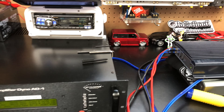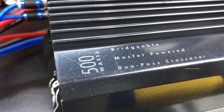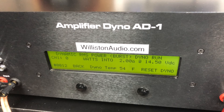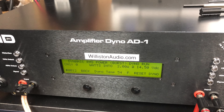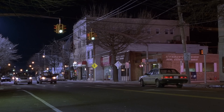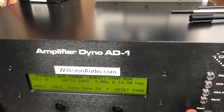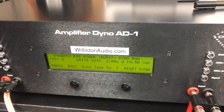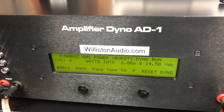Don't do it, don't do it. All right, so this is a useless test trying to get that 500 watts. This amp is only rated to do 4-ohm loads bridged. This is a dynamic run at 2 ohms — kind of like running your engine at redline, well past the redline actually. Don't do this at home, friends, this is just for show. We're going to do a 1 kilohertz track, 2 ohms mono, and see if we can get that 500 watts or the amp is going to go up in smoke. Hopefully we get the 500 watts. Hold on to your hats.